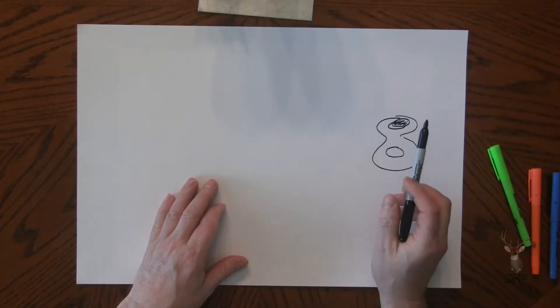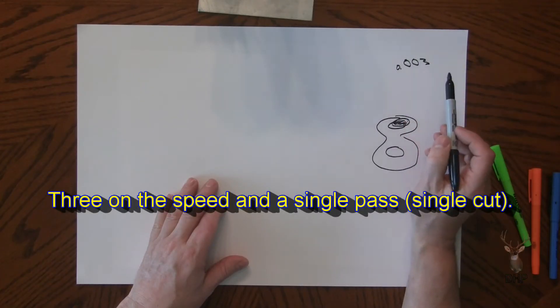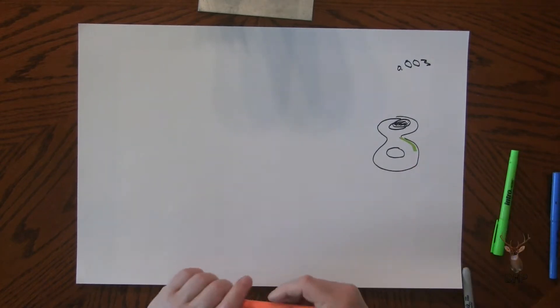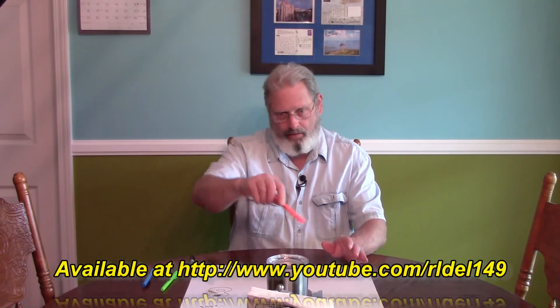One of the things you're going to be aware of is we want to pick nice rounded shapes because they work. He has, I think, three thousandths over-travel and three thousandths offset. What that will do is when you cut, you can cut on the line, inside the line, or outside the line. If you have a very fat object, you might do well to cut inside the line — just make it a little bit thinner. If you have a very thin font, you may make it a little bit wider by offsetting a few thousandths to the other side. It just drives the cut center left or right, on inside or outside cuts.